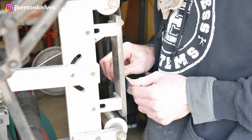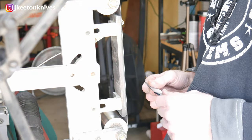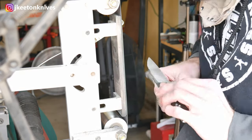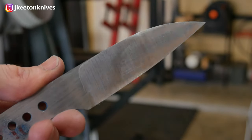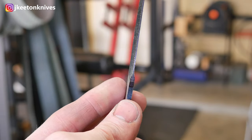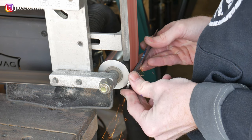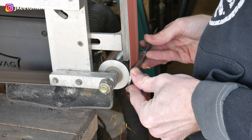This is a step where I try to get my plunge lines pretty darn close to each other so that I don't have as much to do post heat treating. It's worth mentioning that I get this blade around 90% done pre heat treat — so I have about 20 thousandths of an inch behind the edge, a finished edge, and I work back to just about the spine on my full flat grind. Before heat treating, I'll also hollow out the tang to take a little more weight off. I'll be using some G10 handles and they're pretty heavy.